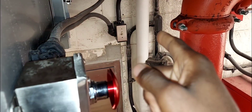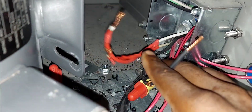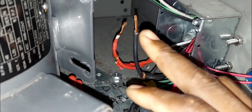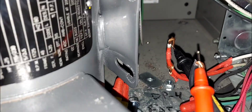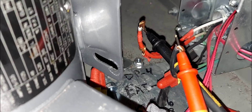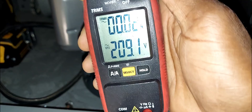I'm going to flip my power switch on and test the voltage coming into this motor. These are my wires, already disconnected, switch is off — it should be 208 volts. Now with my test leads on the incoming power wires, I'm reading 209 volts on the meter.